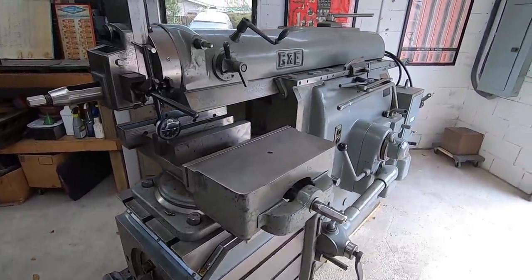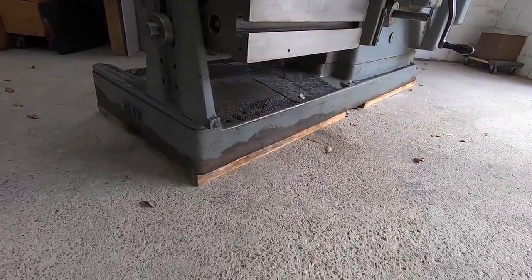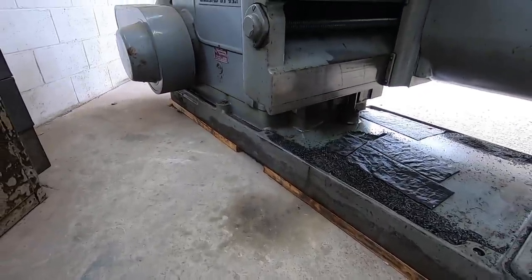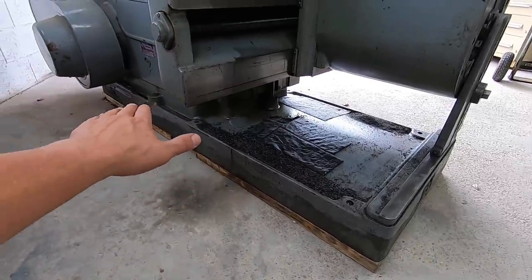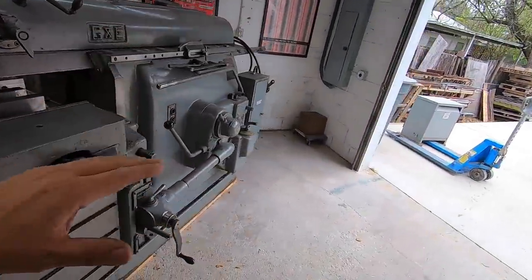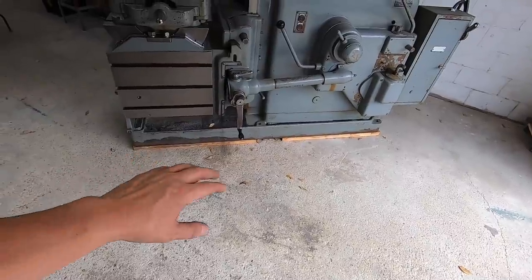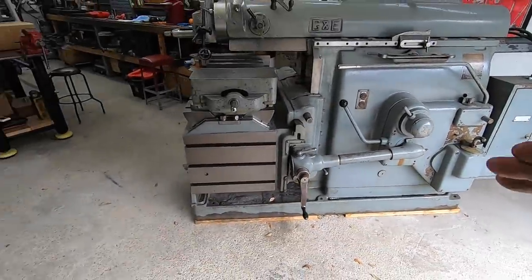When in fact, what's going on here - and this has been going on since I set the thing up - I set the machine on these two 2x10s down on the bottom. And I'm almost 100% positive that's what's been going on this entire time: the base, the whole machine itself is rocking back and forth. As the ram is moving back, the machine kind of slightly rocks back a little bit, and then as it comes forward, it rocks forward. So it's not sitting flat on those boards down there - there's a high spot in the middle somewhere. So it's just slightly rocking, not a lot, but just enough.